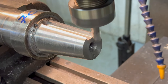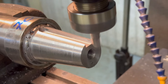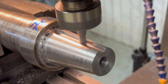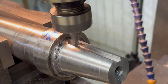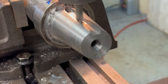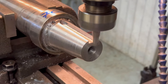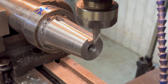Here we see the shaft mounted in the vice on the milling machine. The milling cutter is a slot drill, 10mm diameter, to cut a keyway parallel to the shaft taper on the cone, so that it can take a keyway to lock into whatever goes on the end — I think it's a pulley. That's going quite nicely. I've speeded it up slightly — I can only take about half a millimetre to a millimetre cut at a time, and it's got to go in about four to five millimetres.